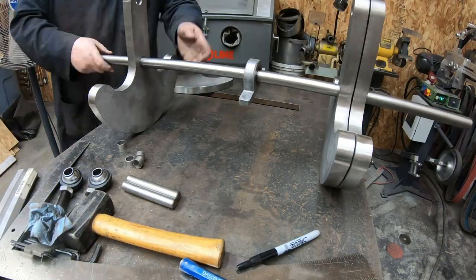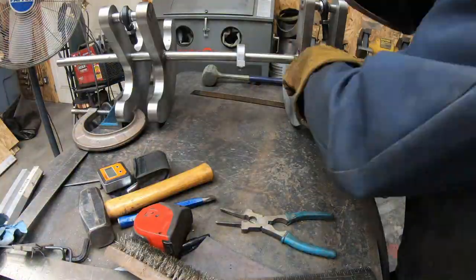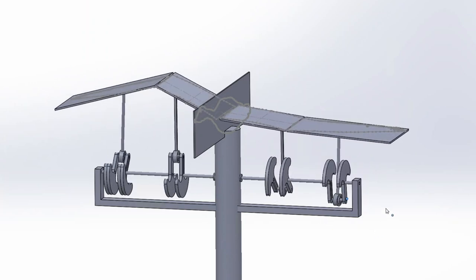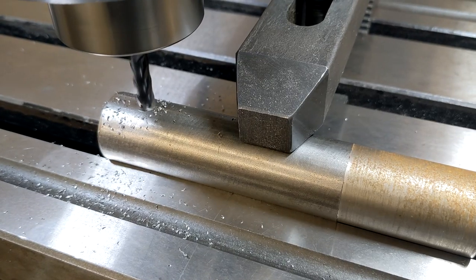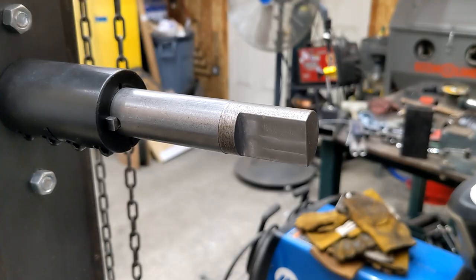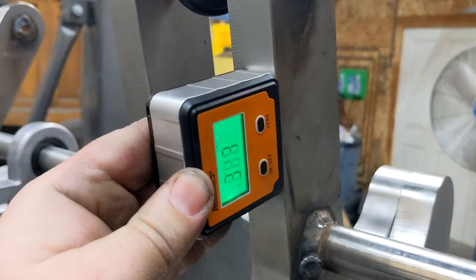The second crankshaft came together in much the same way as the first, except for the critical mistake of forgetting to clock the keyway on the shaft to have the same relative angular relationship to the cranks as the one on the first crankshaft. There was much swearing. Without both sides sharing this angular offset, the wings wouldn't flap in sync with each other — wing phase must be maintained. I could have cut another keyway on the crankshaft, but getting it set up true on the mill seemed daunting. It seemed more reasonable to do this on the short shaft that went through the column connecting the two crankshafts. I made a little widget with a keyway on one end and a large flat at 90 degrees to it on the other. By mounting this with a rigid shaft coupler, I could use an inclinometer to work out the relative relationship on the first crankshaft, then use it to set up the central shaft on the mill with the complementary angle. And it worked.